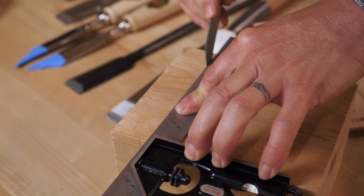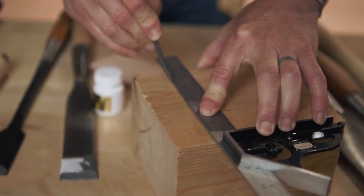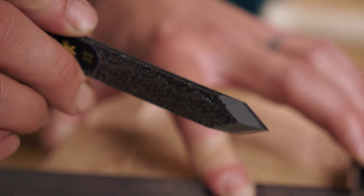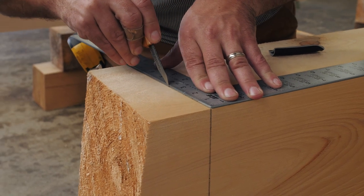This is a knife that is specific for marking. Before we start chiseling, after we've laid out a joint with a pencil, we like to use this marking knife to actually slice the fiber — it gives us a very specific point that we are chiseling and slicking to. What sets a marking knife apart from any other knife is that the backside is flat and the front side is beveled, and that beveled edge tends to push the flat side tight to your straight edge. So you lay your straight edge on the timber, put the marking knife against it, draw back toward you, and the beveled edge helps keep the knife tight to the straight edge. This particular marking knife is Gaius's favorite because it is beveled on both sides, so you can use it either way — it gives you a lot more versatility and you don't have to be left-handed or right-handed.